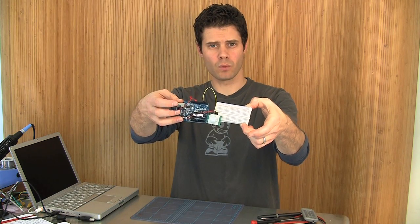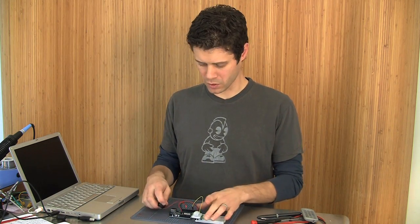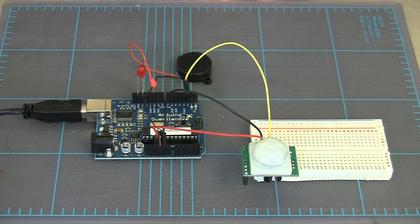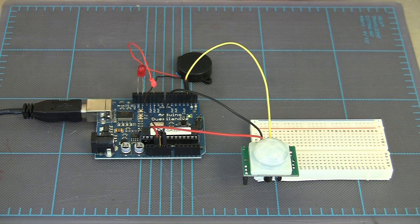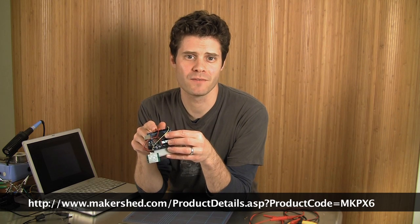So that's the whole kit and caboodle. When prototyped out you could neaten this up if you're going to do something more permanent. Now I'm going to plug in my computer and upload the program from the Arduino software. Once it gets on there it's going to do a little test of the IR in the room to get a baseline, and once it's done it'll be ready to sense movement. The sketch checks pin 2 to see if it's low or high — when the sensor detects motion it sends a high signal, which I do a digital read on, then tell the piezo buzzer to buzz and blink the LED.